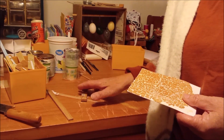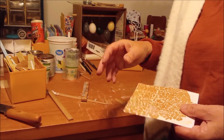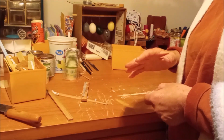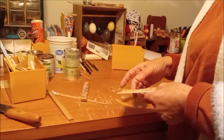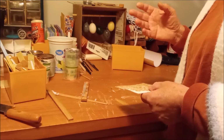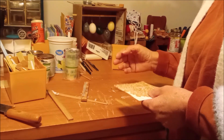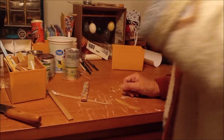The other option is to pour the concrete, divvy it up into little squares, but we wouldn't make them all the way through, so it would just look like they're divided into squares. And we could put a sealer on that to see how that would work. Or we could go ahead and use the concrete and make little tiles and use caulk for the grout in between the tiles. That is an option. And then seal that. So we have three options to do, all of which are labor intensive.